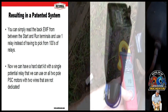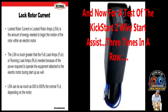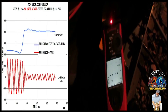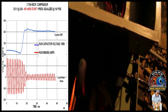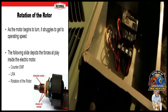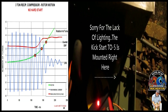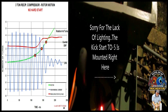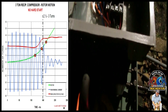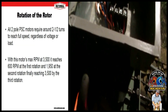Alright, I think I'm going to leave that on there. There's been a little controversy about my 2-wire Kickstart that I added to my Rheem here in my last video. The research that I've done tells me that this one is not like all the other 2-wires, because it actually has a potential relay. So even if it has to restart several times right close together, it should do it every time — just like the regular 3-wires.